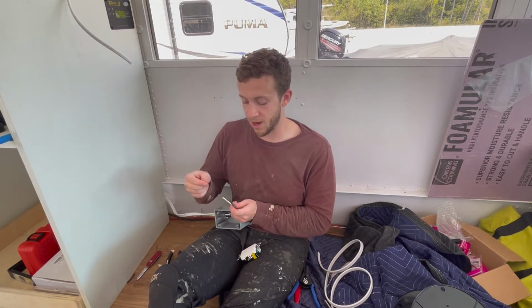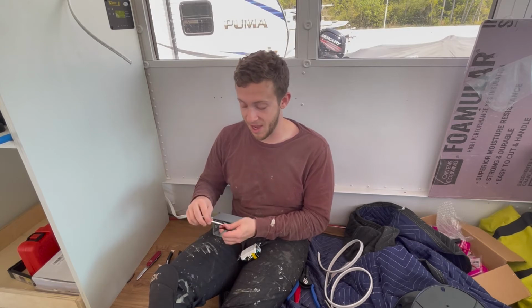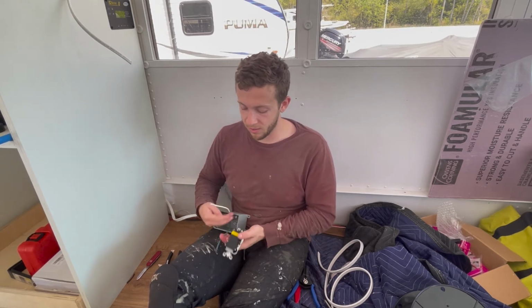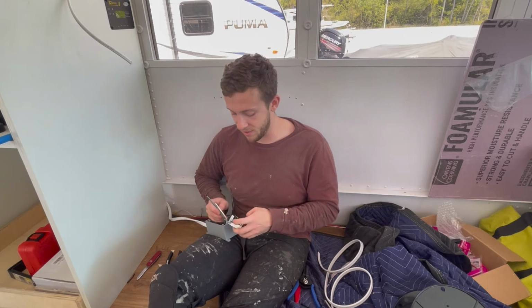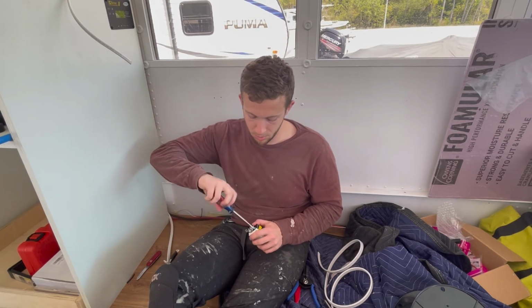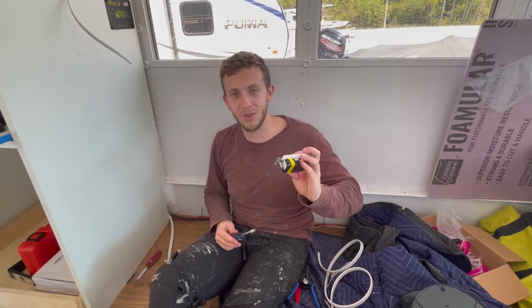Instead of trimming back the wire from the very end, we are going to do it in the middle, and we're actually going to leave some hanging off, which is what we want. So we're going to start with the green, the ground. It's going to be like down like this. You find the green thing. It's pretty clearly labeled on the back of the outlet itself, but I'm just going to loosen it up. And these screws don't actually come out, so you have to just kind of make it work.